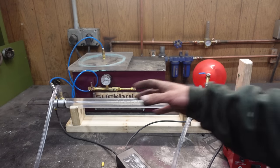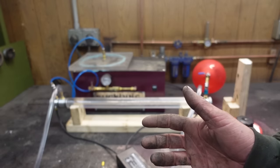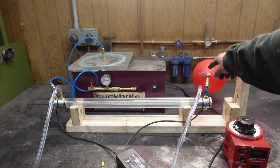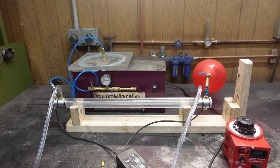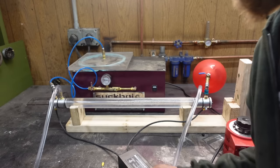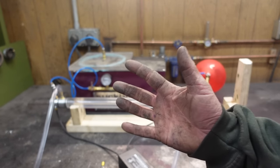We're all set up. I've tested the water system — it works, no leaks despite my lack of hose clamps, besides in the pump housing itself on a brand new pump. Harbor Freight! We have a Schrader valve on the vacuum pump hooked up to one end of the glass tube and our balloon on the other end with a ball valve, so we can pull the air out and fill it with our gas mixture. The power supply we're using is a neon light transformer with an output of 10 kilovolts at only 30 milliamps — but 10 kilovolts. That's dead voltage, so we're going to be very careful here.